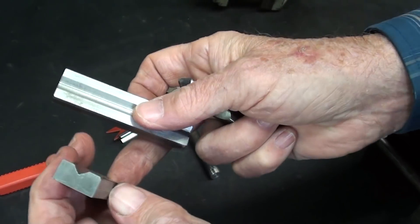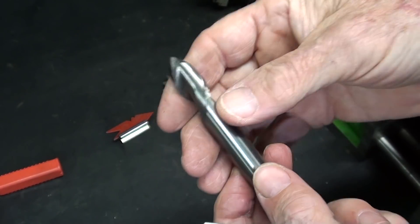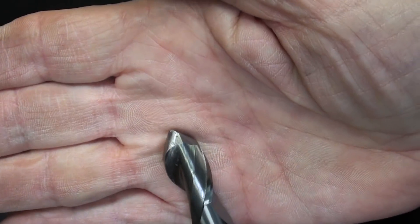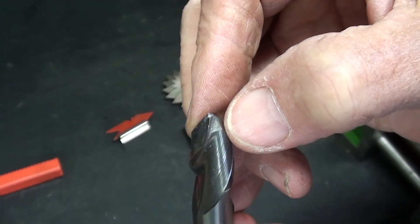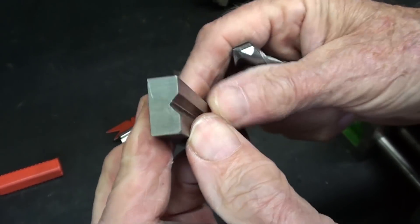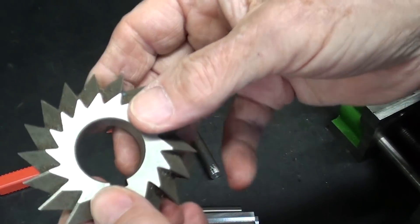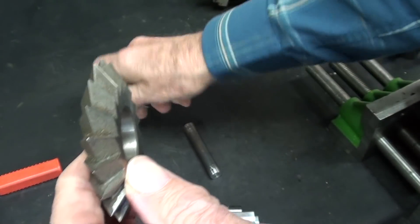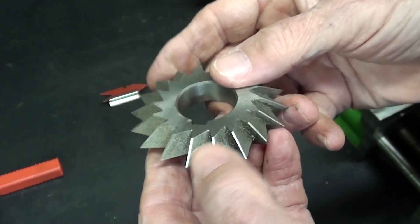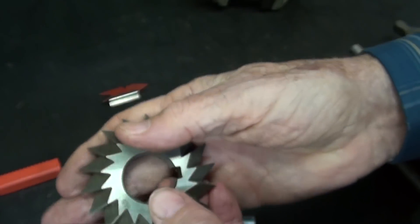The jaws are completed — some nice V-ways in there. Now, I will admit that this cutter is probably being misused for what I just did, because this type of cutter plows through at the actual point and isn't capable of cutting right there on the end. In some ways it's kind of rough, but it doesn't matter for this project. The better way would be to have a cutter like this — this one is 60 degrees, but you can buy them in 90. That would give you a nice cut on the horizontal mill, and that's really the correct tool.